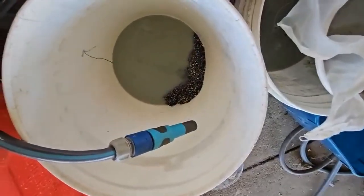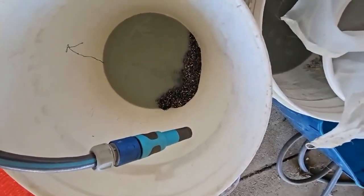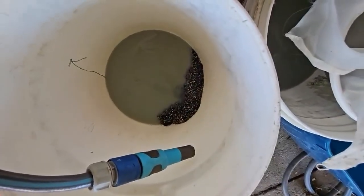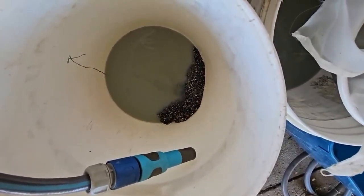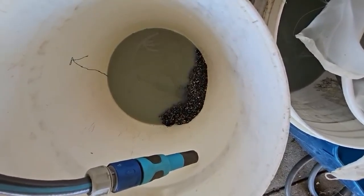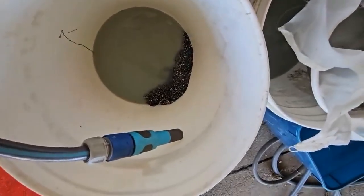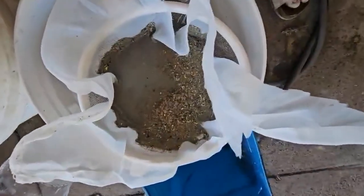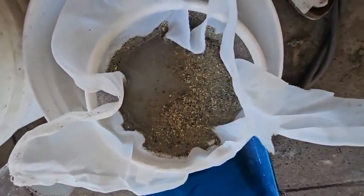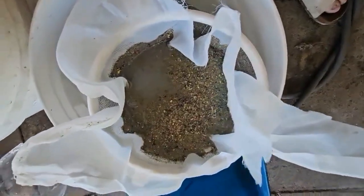These are the chips that were in that blue base bucket or tub. Because we put so much nitric in for the nitric bath, we had to decant it into this bucket. The process is now at a stage where there's no reaction — it's got rid of most of the waste. So I'm filtering it into a sieve and then going to process it in a small beaker, which will make it easier because I can put it on the hot plate and go from there.